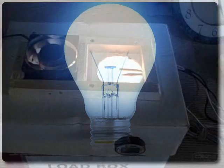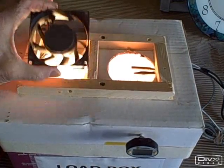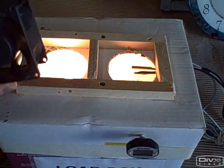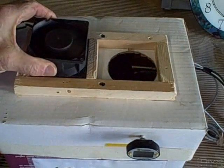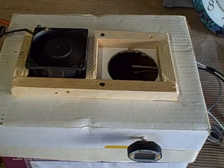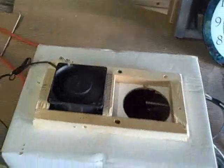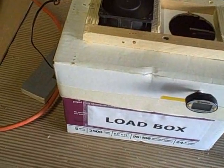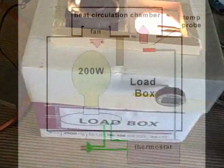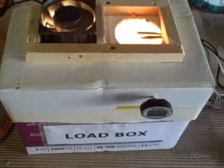What you're looking at is something called a load box, and we're using the load box to measure the flow rate of this fan. With this fan, we're blowing air across a 200-watt light bulb. When the air blows across the light bulb, it's taking the heat from the light bulb, blowing it through the box and back out across these temperature probes. So we're going to measure how long the light bulb stays on to maintain a constant temperature inside the box.